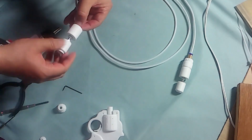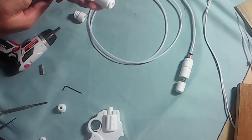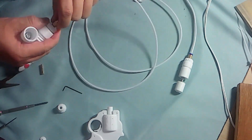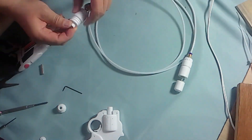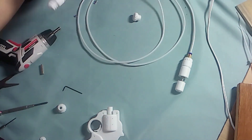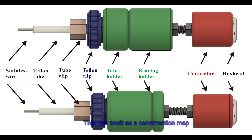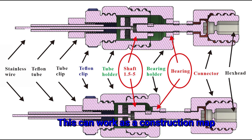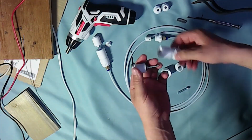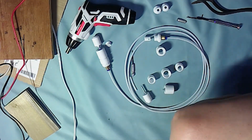In fact, if using both sides, all of the parameters must be precise — especially the length of the wire and the length of the Teflon tube. I had to change the design again: if we shorten the bearing holder, it should be ok. Changed the design and printed it out. This time it works.